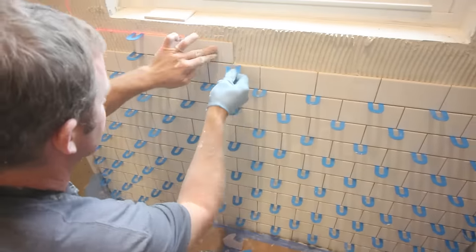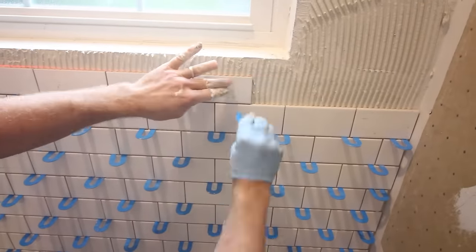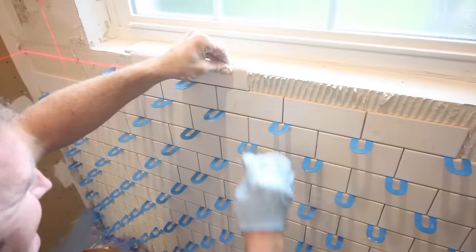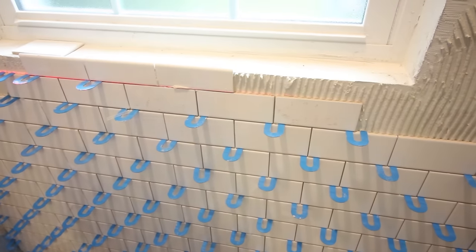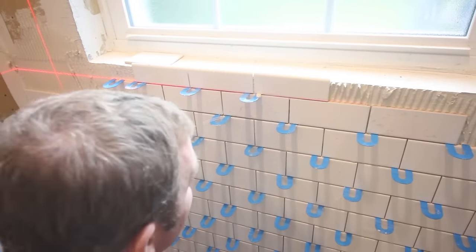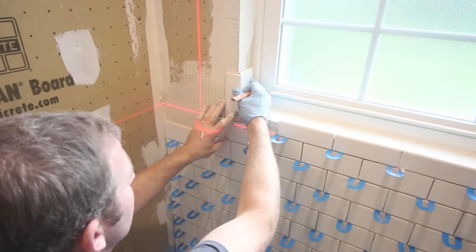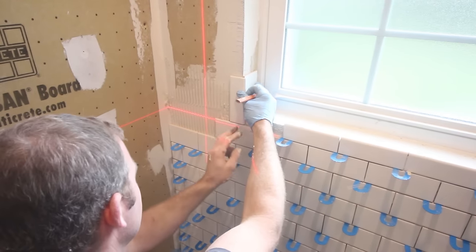We did cut down the height of the tiles that are directly underneath this window so that we could fit the bullnose in. We centered the bullnose on that last course of tile and continued to use our horseshoe shims. The reason why we're doing the smaller tile just underneath the window is you won't really notice the difference when we go outside the window width. We're doing this underneath the bullnose so that we can make the bullnose look good, making it proud and then filling in thinset to make this work.